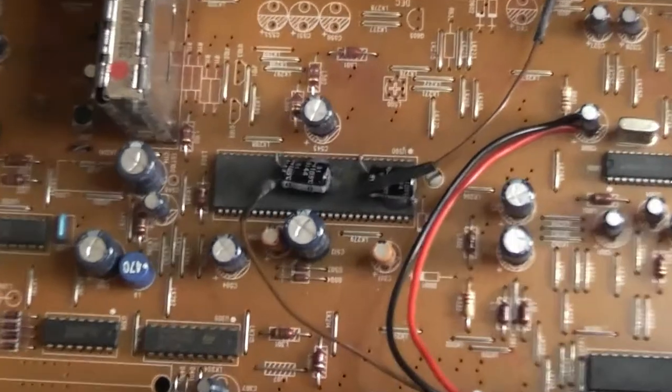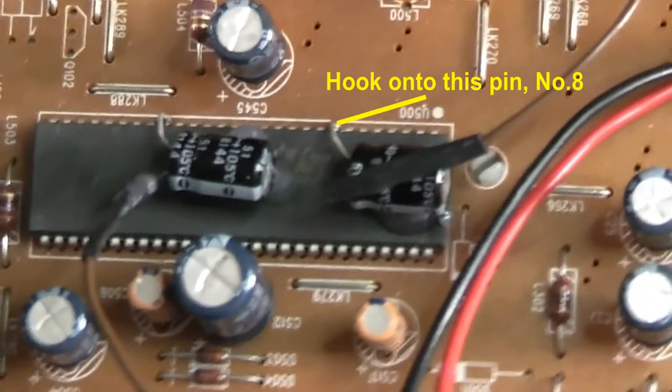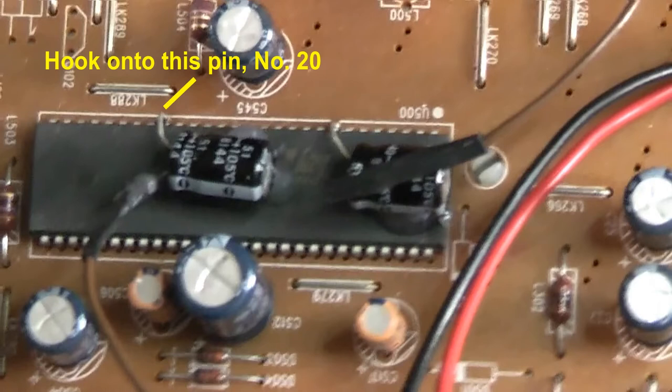There are two simple alternatives I came up with. The simplest is to capture the baseband signal where it leaves the STV0056A video processor and route this to the outside world. The second option is to inject valid sync pulses at a low level into the STV0056A just strong enough that the Zilog controller thinks it has video to lock and hence no blue screen.